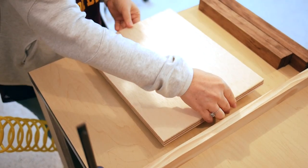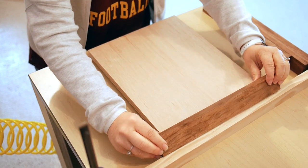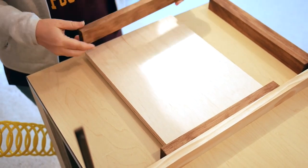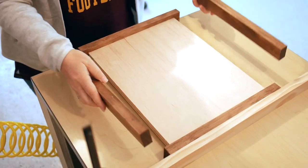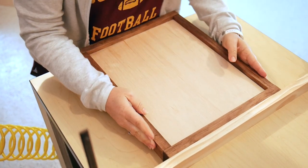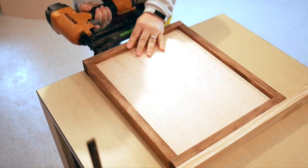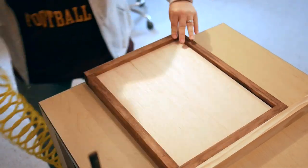To affix the stained trim, use a finish nailer with one-and-one-quarter inch straight finish nails. If you don't have a finish nailer, you could use wood glue. Underneath the wood canvas, I placed two paint stirrers to create a border so the trim is not flush with the canvas. Hold the finish nailer firm to the frame keeping your fingers clear. I used a scrap piece of wood to create a backstop so that the frame would not slide as I was pressing the finish nailer against it.